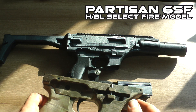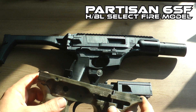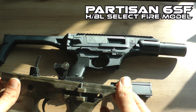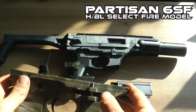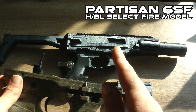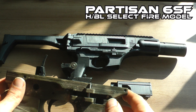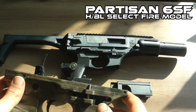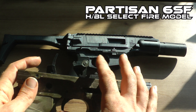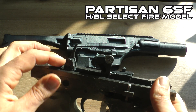In this video I want to cover some troubleshooting with your SF model. The best way to diagnose with an SF bolt-on full automatic is with the slow motion camera settings. Use your smartphone and go really slow, scrolling through especially when the bolt is closing. You can diagnose a few things, and also look at the release of the hammer to check if the timing is correct.